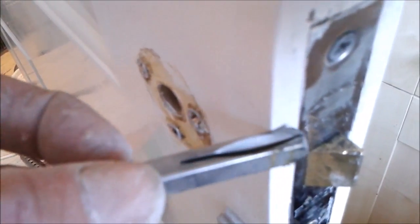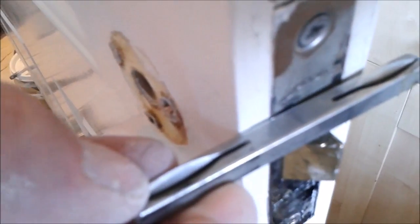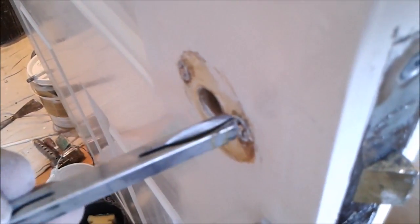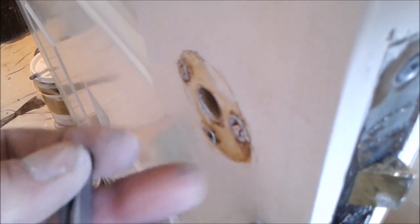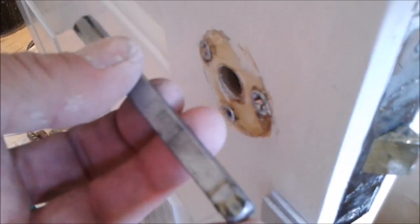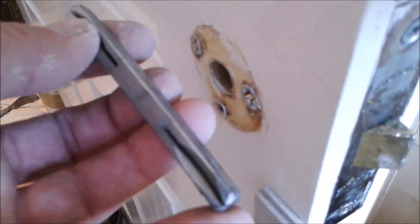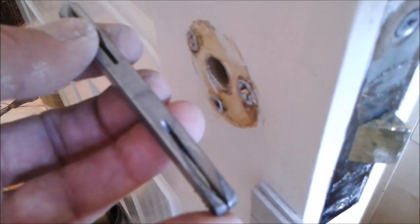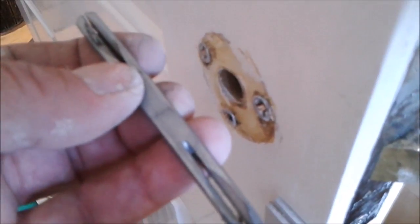These spindles are just too short for the door, so there's nothing to grip on one side. Every door handle around the property is failing on one side because they've been built and finished with the wrong spindle, and it's just never been addressed — which baffles me.